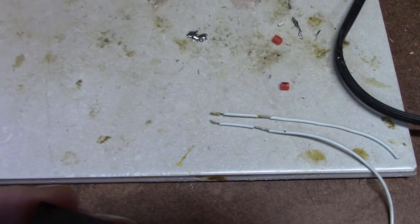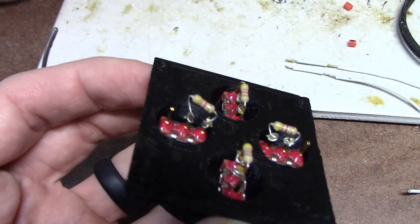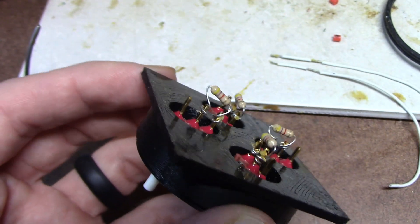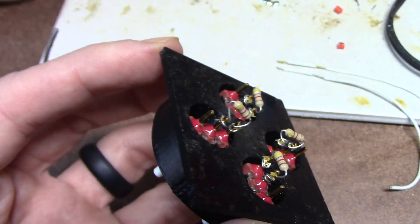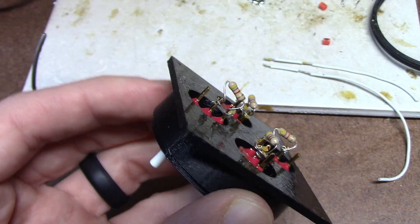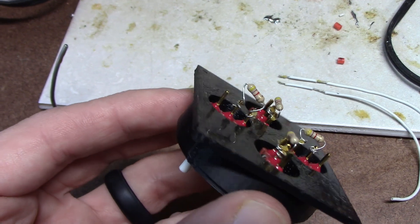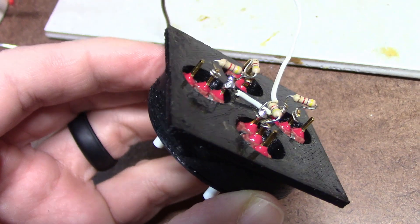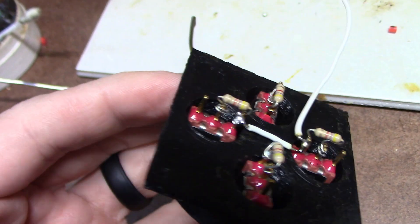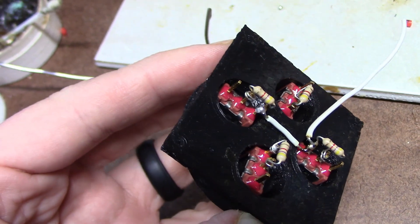Now I'll solder these. I also prepared two wires — this is a servo lead, so those will be my signal wires going between the two switches. I'll very quickly solder the resistors on, tin the wire, and wrap the wire around. When doing this, I don't want to apply the soldering iron for too long on the switches, as it can melt and damage them. The first switch is soldered with the connecting wire, then I'll wrap it around and do the second one.